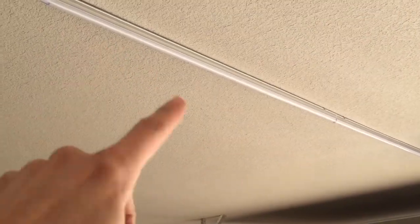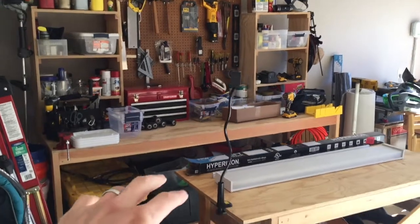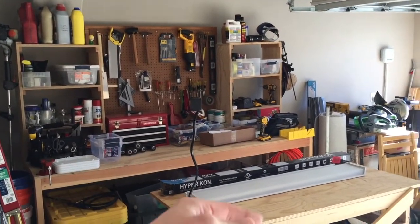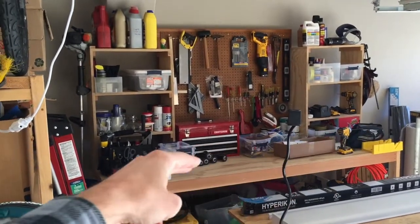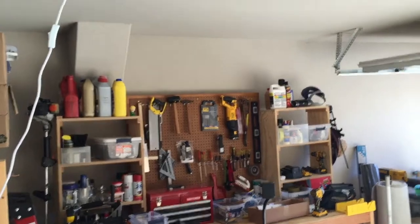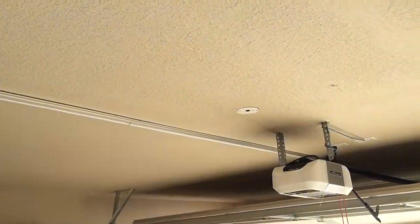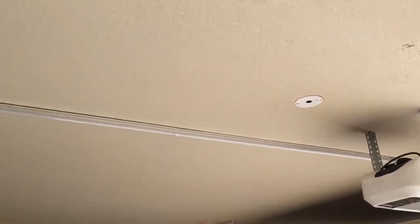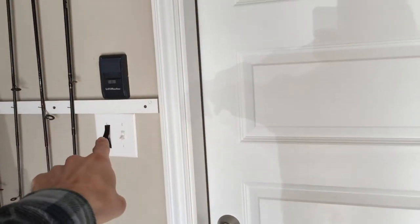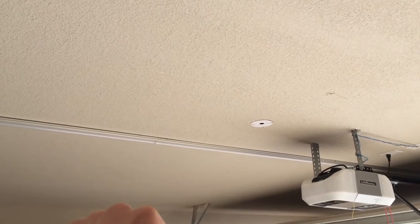There's one of the three-light runs I'm going to do — one run there and another one there. My main workbench is here, so I wanted a row of lights on this side of the workspace and another row over that area, so where I work is really well lit. We're going to do three there and three there. The original four-foot fluorescent ran out of that plate and was tied to the switch on the wall. Since I've got the wires exposed, I wanted everything to run off that switch, so I removed the old fixture and put a plate over it.